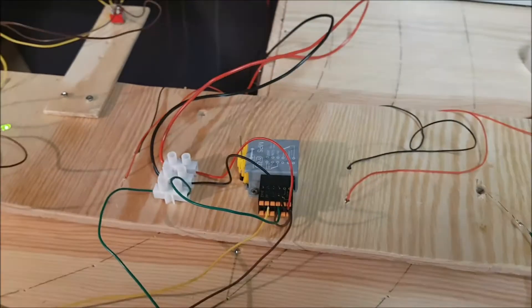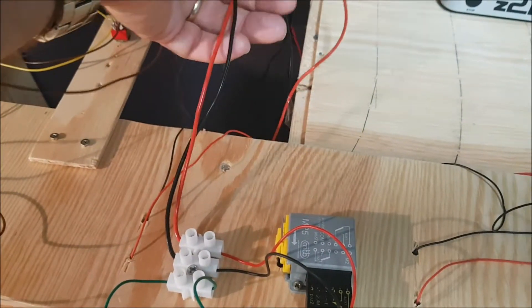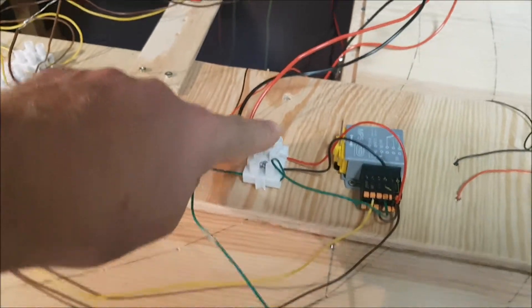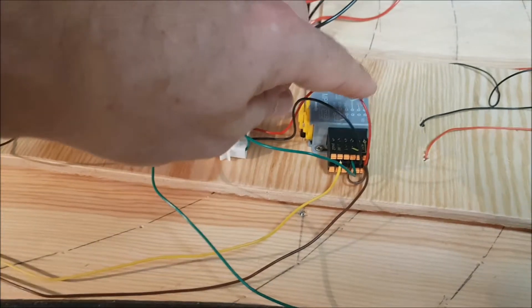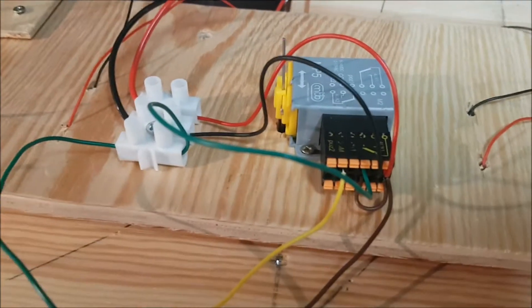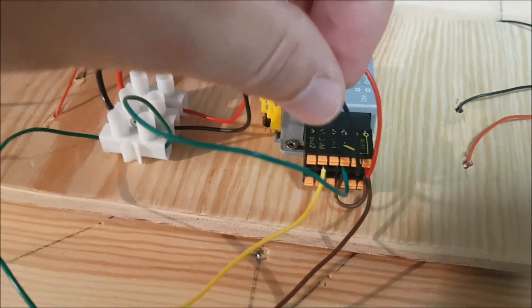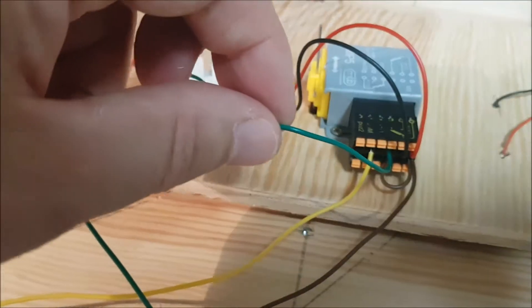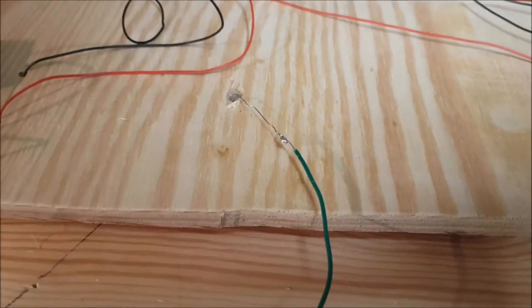The last thing here is the AC power supply. This is the AC coming from the bus wire into this block and then straight on into one of the auxiliary contacts of the MP5 motor. This coupling with the red and black wire then feeds the green wire coming out of there, which then goes on to the frog.